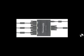Additionally, the digital TripleHead2Go now gets its power from a USB connection, rather than the AC adapter used in the original analog version. Furthermore, the USB connection now allows for user-installable firmware upgrades. With the original TripleHead2Go, firmware updates could only be done by Matrox. The ability of the user to perform firmware updates has already paid dividends, with the release of the center monitor as primary firmware update. Previously, users would have been required to RMA their units back to Matrox to receive this type of update. This design improvement offers both a better customer experience and, one would guess, lower support costs to Matrox.